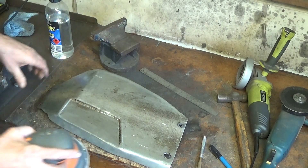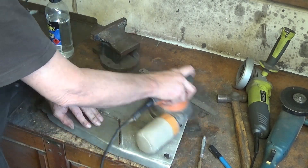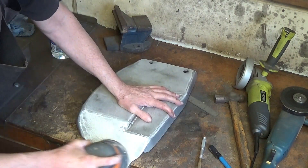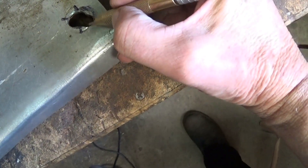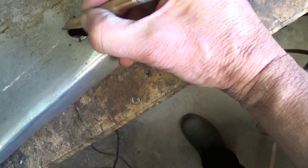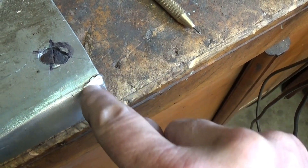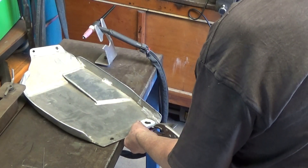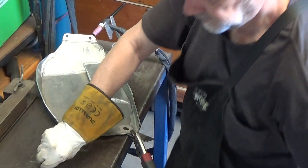So it's back down to the shed again and I'll give the plate itself a bit of a clean up. And this needs a bit of a repair too. The last time I fitted it, all I did was enlarge the hole to make things fit. Well, I'm going to fill that hole up and re-drill it. And also, there's a little crack here that I'm going to weld up while I'm at it. By clamping a bit of steel on the back of the hole, I can weld up the hole without the aluminium running out the other side.